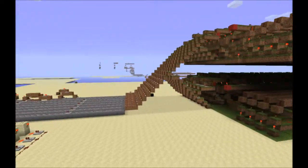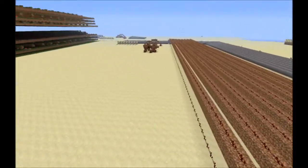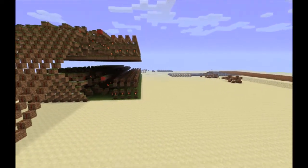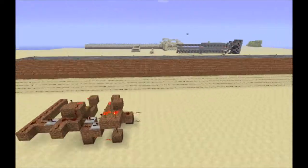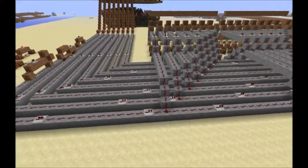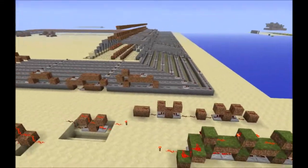So what else is needed in this CPU? What's needed is the ALU, all of the wiring in the middle that controls everything, the memory address registers — the MAR — and one of the most important things is what I call a two-way repeater: something that will send signals both ways. And this is the biggest problem I've had so far.